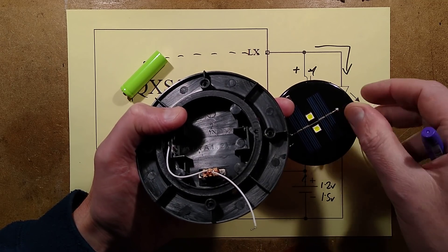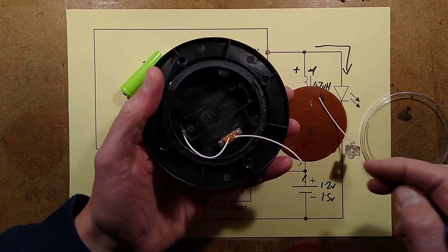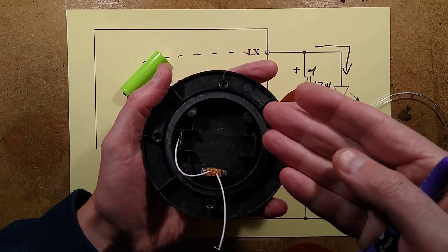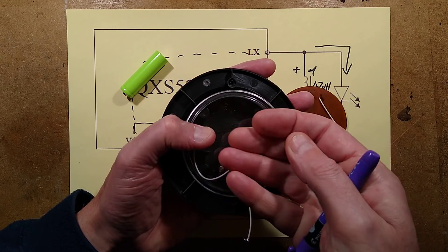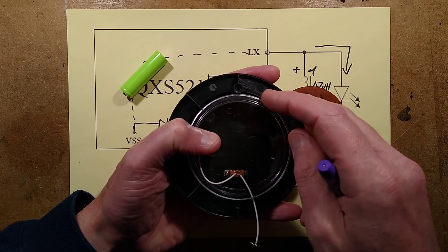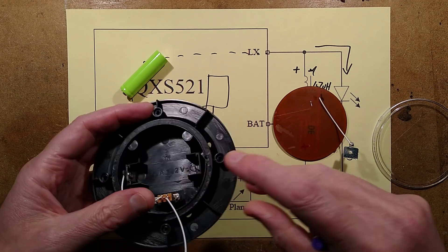You could probably drill a small hole if you wanted to salvage one and access the solder joint that way. But yeah, quite easy to break - good to know. The middle bit has no drainage holes, which means there's a risk that moisture will gradually ingress. As the heat of the day heats it up the air expands, and then if it's raining with a rim of water around the edge, as the air cools down at night it will suck the water in. It happens with lights all the time.